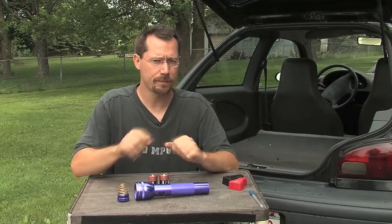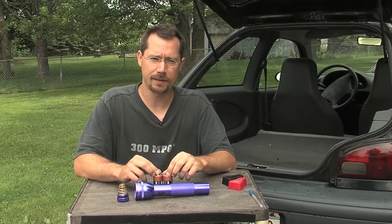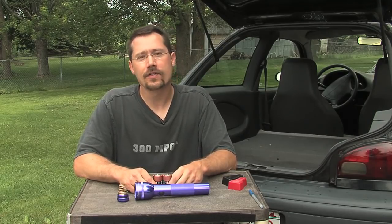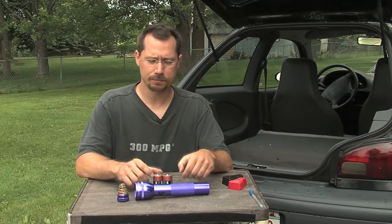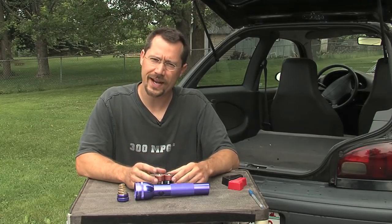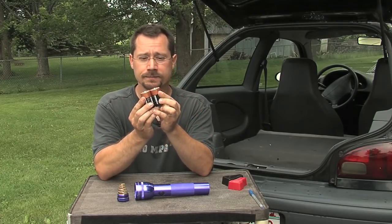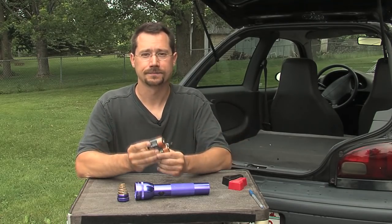The main advantage of running all batteries in parallel would be if you only had a 12-volt charger and wanted to charge all batteries at once — but that's not a very good reason. Another option is buddy pairs: if your batteries are a little small for what you need, you take a pair of batteries, put them in parallel, then connect that parallel pair in series with another buddy pair, and another, and so on, until you reach your target voltage.